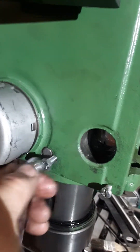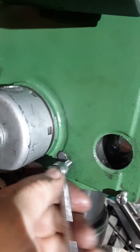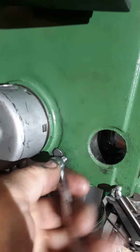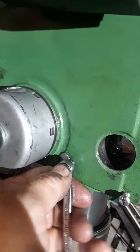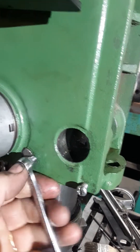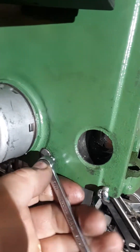All this is in preparation — I'm going to put a DRO on this machine, and from the videos I've watched, they seem to be pretty sensitive to any outside movement. They're designed to see movement only along the axis of the DRO reader to the encoder.